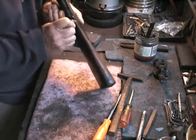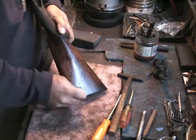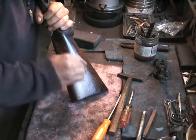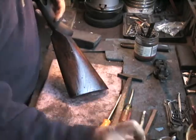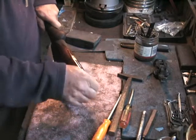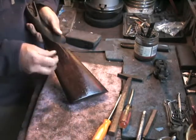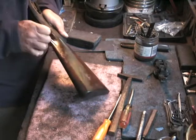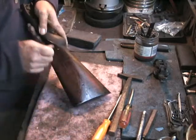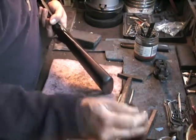The full wood refinish will be obvious — the gun will look like a new gun, the wood will be much lighter and near perfect, there'll be no deep scratches in the stock. That looks pretty, but frankly it's not going to help the value of a collectible gun. What I'm doing here is really more of a cleaning than a refinishing — just cleaning that surface film off. Stay away from the checkering because you'll just fill up the lines with slurry if you get into it, and then you'll have to clean them out, which is pretty much the same as re-cutting — and that's laborious.